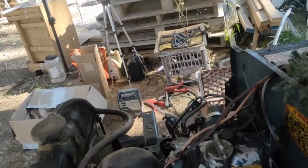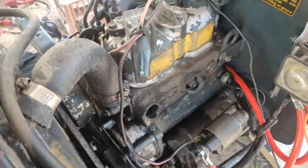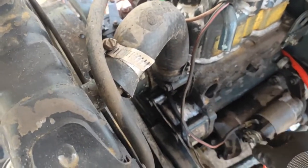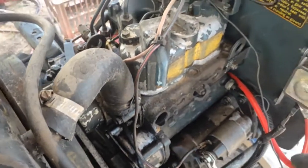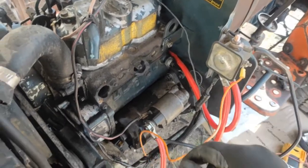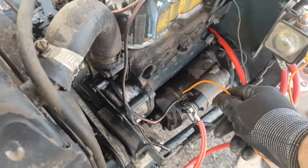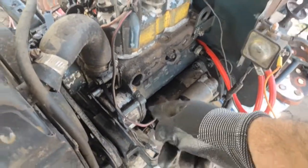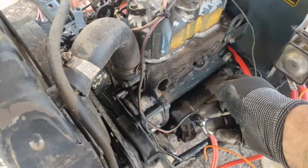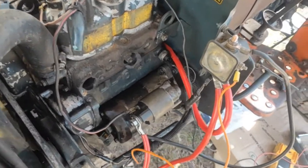Well, anyway, back at it today. Now I worked out that the solenoid is not switching power from the battery to the motor inside, so something is loose. This is very loose here. I'm going to be using a separate solenoid to feed the power to the motor. The only issue I'm having right now is that I can't connect the same wire to both relays, because they'll kick in at the same time, and this plunger I think has to go first and then the motor has to go second, so it's not working perfectly.